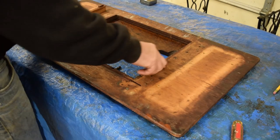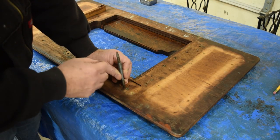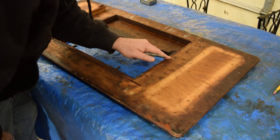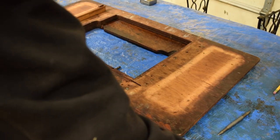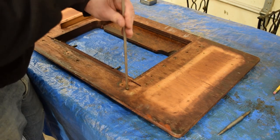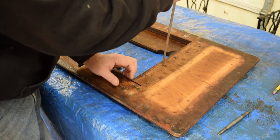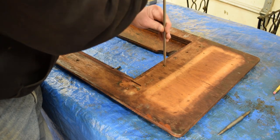There are seven screws that hold that face frame assembly, the two-piece face frame assembly, on. And what I do to prevent confusion when I go to put this back together, and it's been re-veneered and I don't know what holes I'm supposed to drill through my veneer so this mounts, I mark these with basically just a little ding. So by each of the screws that hold on a face frame assembly piece, there'll be a small little ding. And that way I'll know where to drill my holes when the time comes.